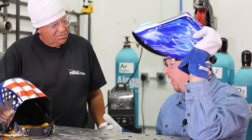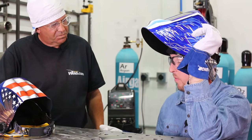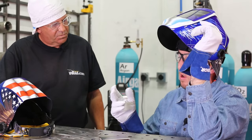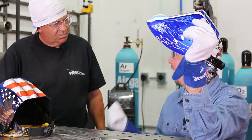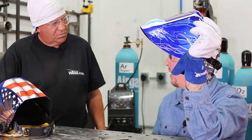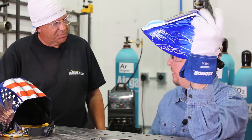I operate on a different mentality — I take it just a little higher than the material thickness is going to allow, because other than that you don't need it. I don't get a chance to use a lot of pulse capabilities at work, so I'll wind up using my foot pedal to do the pulsing and adjust my heat on the fly. Manual pulse with the pedal. Exactly.